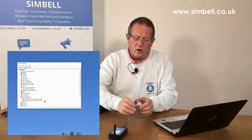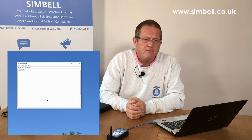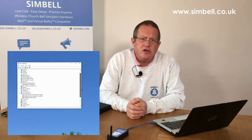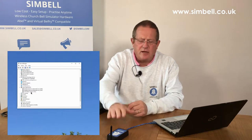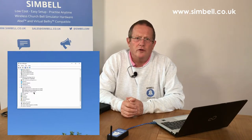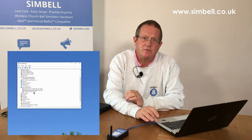If I take one of our receivers and plug the USB in, you'll hear a noise, and we now see that an additional COM port device has been detected. It's identified as a USB Serial CH340 — that's what this receiver is — and it's assigned as COM1. We must remember that COM1 is the port for this particular USB connection.